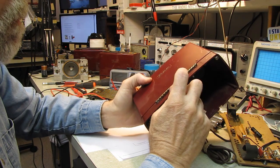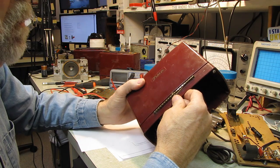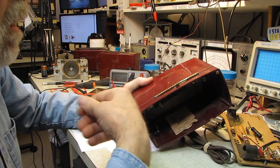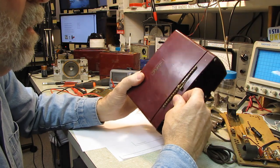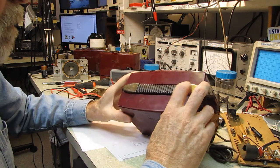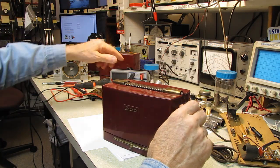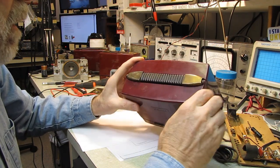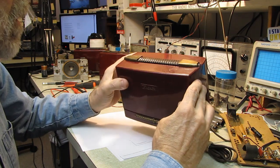But that's all right. If I polish this up, put a high luster polish on here, I've got some brass colored paint. It's more of a tint on order. And if I paint those and then give them a couple of coats of tinted clear lacquer, they'll look just fine, as will these. These appear to be plated aluminum. They're certainly not brass. The one that I tested on, there's one over there, it just shines up like aluminum. So we'll polish these up and give those the same treatment. We'll give those the brass with the tinted clear over the top, and they should come out all right.